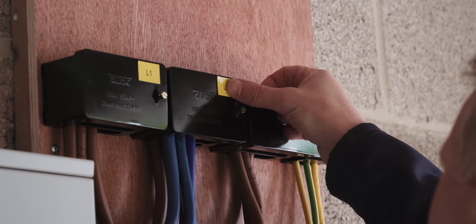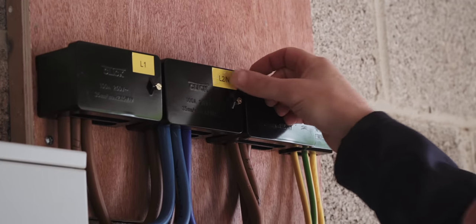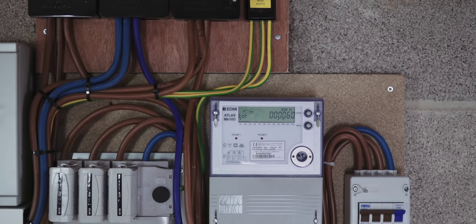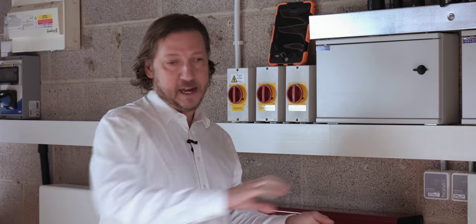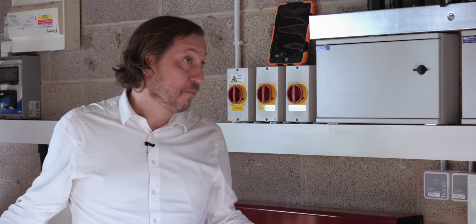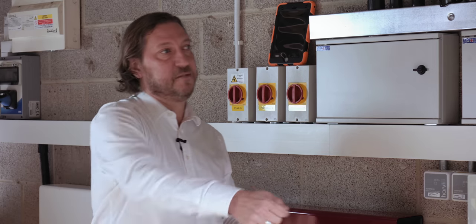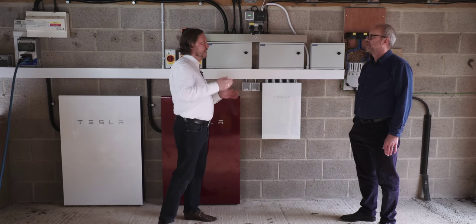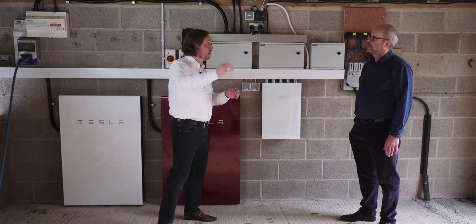It's quite an unusual thing in the UK to have a three phase connection to a house. If you look at the wires running down the street, they are three phases. But whereas in Germany they tap off all three phases into every single home, in the UK we just pick one at random and wire it into a house — phase one on this house, phase two on the next house and so on down the street.